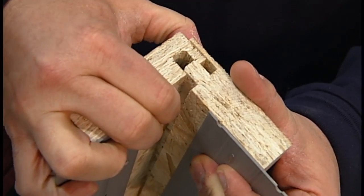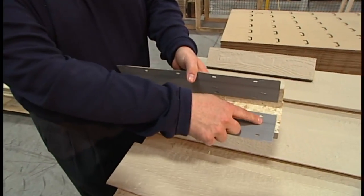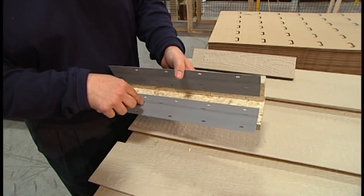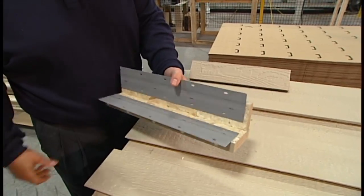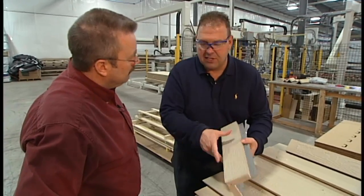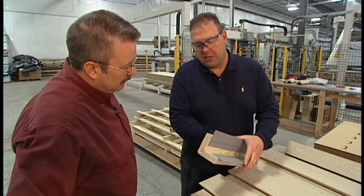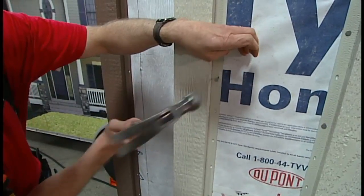You'll notice we apply a vinyl nailing fin using stainless steel staples which will actually fork out once they're installed — great holding power. You're not just going to simply pull these off. So we talked about the avoidance of face fastening. We don't want to run any fasteners through the face of this. With this one piece corner and the way we apply this vinyl nailing fin, we don't have to worry about it. You're going to fasten through here.